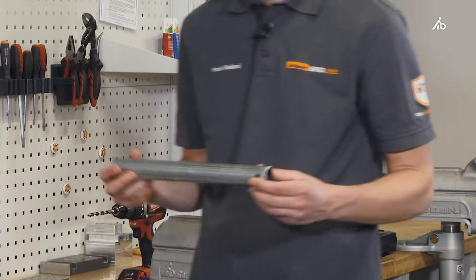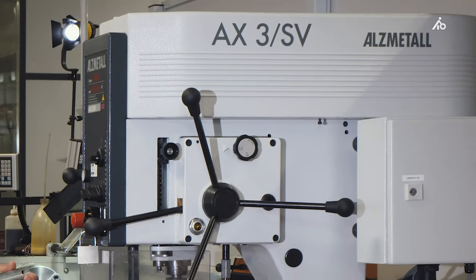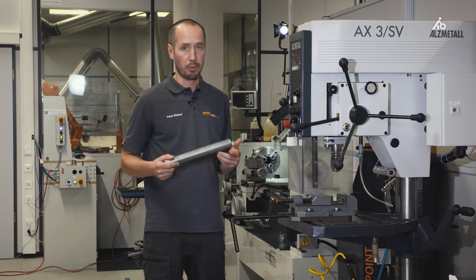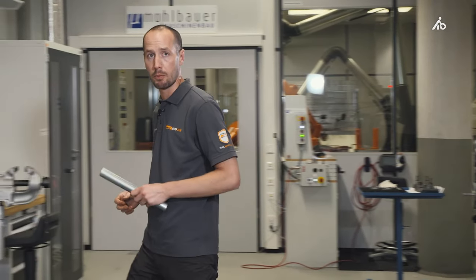I can remove the adhesive tape, and now I am drilling. The classic option is a stand drill — here is one. There is a guided drill, so I do not slide off on this convex surface, and I get a nice hole. But there is also another tool: our stepped-tipped Garant HSS drill.